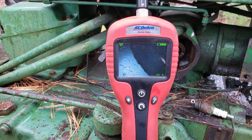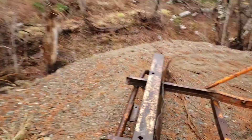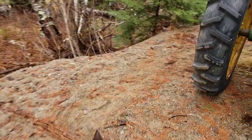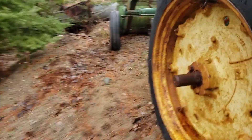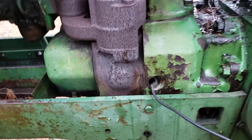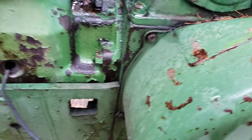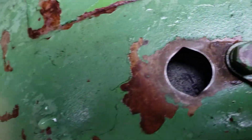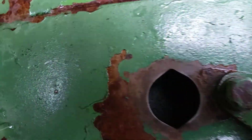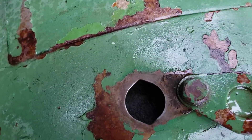Let's see how close I am. We'll go around the tractor and see if we can see the five-degree timing mark. There's my borescope in the plug hole — don't want to get it too far where you crush it. Now we're going to look into the timing hole and see if we can see the five-degree mark.